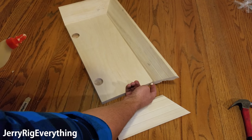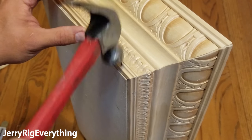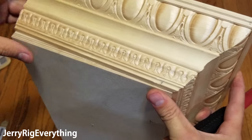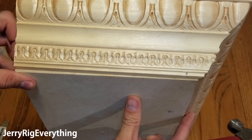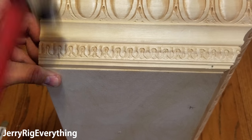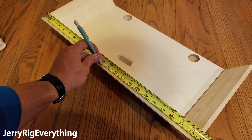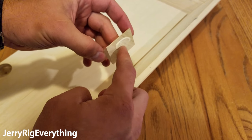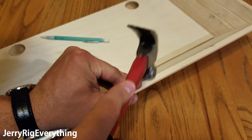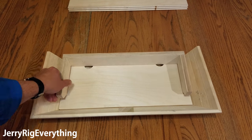I add wood glue to all sides just like usual, and then get that bottom corner next to the seam nailed first. Then I'll nail that top corner of the molding to get it to line up perfectly. This crown molding was just a tiny bit off with that angle cut, but since I've already lined up that corner seam perfectly and nailed it into place, it can flex a little bit before I nail it to the base of the shelf, and the seam will still be perfect because it was nailed first. Inside your kit there is a small angle of wood — this is part of the latch. I decided the strongest place for this latch is in the center of the shelf. Add a little bit of wood glue to the bottom, then nail the little sliver into the crown molding with small finish nails — one on the top and one on the back side, making sure the nails aren't going to poke through the shelf into the front. If you have any extra small finish nails, feel free to spread them around the rest of the trim so everything is held securely in place.